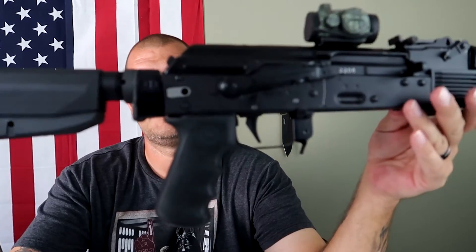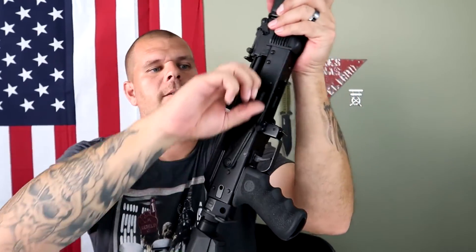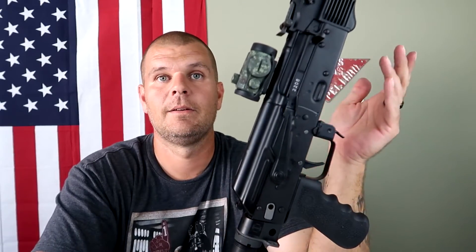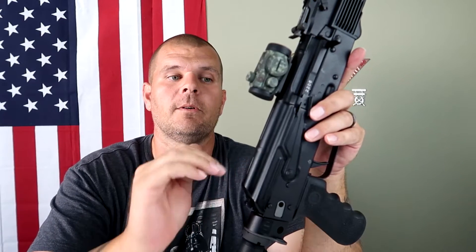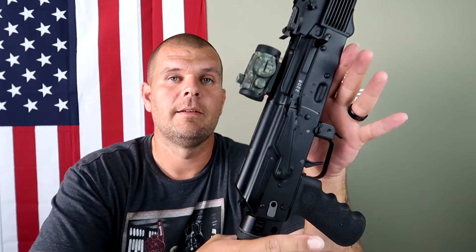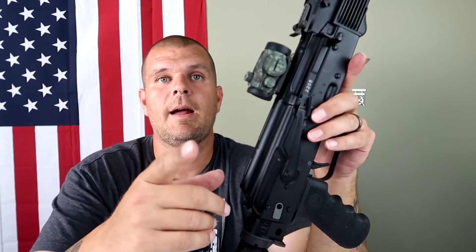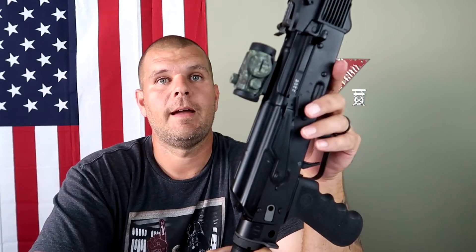Installing the trigger was really easy, especially for never doing it before. I did it without a problem. Everything went in. I had to put the roll pin in for the safety to actually function. You see the safety does work - it's not firing on safe. Take the safety off - fires. The safety does work. I filed it down with my Dremel tool. The rear little tang sticking out of the back of the sear sits over the rivet but it's not hitting it when the trigger is being reset or depressed. I am going to keep an eye on that - things get more violent with live rounds. I will monitor it after its next range visit.